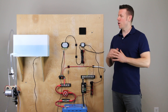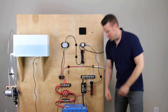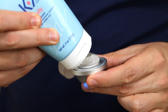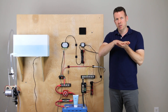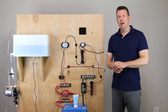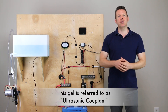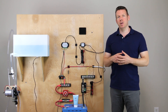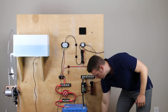To get started with calibration, we're going to drain the tank as far down as it will go. One more thing to note: I used some KY jelly on this Safari sensor. With ultrasonic sensors, they need solid material between the sensor and the top of the liquid — no air gaps. I talked to Bruce at Safari and they confirmed you need some kind of gel or coupling. KY jelly works, or you can use dielectric grease, but make sure there's no air between the sensor and the bottom of the tank. So let's drain the tank.